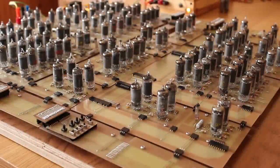Alright, it's the next day. I got my bodge wire in pretty late last night, but I think everything should be working correctly now. The majority of the problems seem to be stemming from the carry register. Aside from the fact that I had the input signals switched, it also seemed really slow to do anything unless it had been warming up for like 10 to 15 minutes.